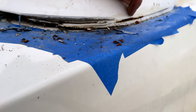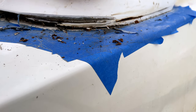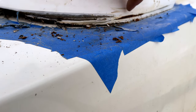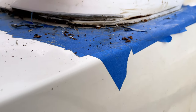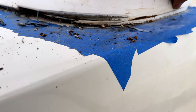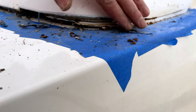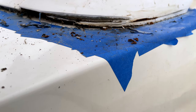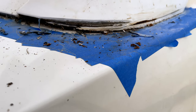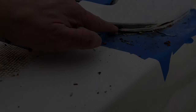But literally, this timber's just under the surface of this sort of gel coat fairing finish, so not ideal. So I think we need to grind that out, probably at least this sort of thickness, so what's this, 6 to 8 millimeters, get it right back, make sure it's fully dry, and then we could epoxy, thickened epoxy, and fair that, and that'll be a nice repair. But a little bit surprising, to be honest, but that's all part of the adventure with this boat, it seems.